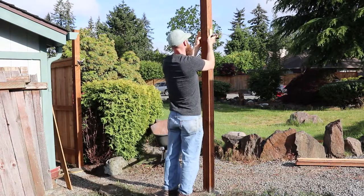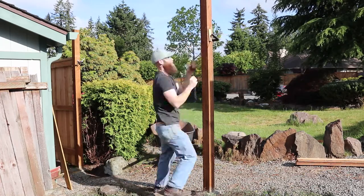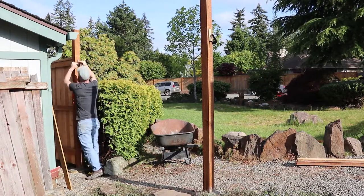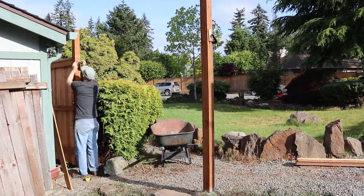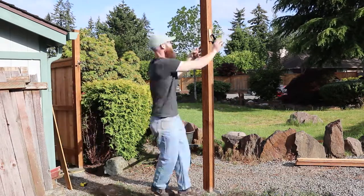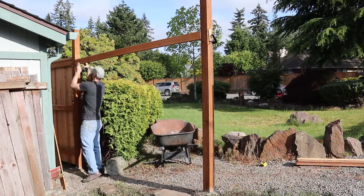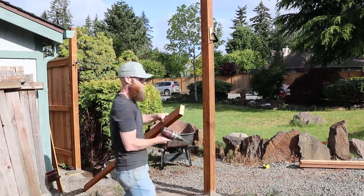You could use cedar rails, but they're a little bit more expensive. One thing that's nice about cedar is that it is naturally resistant to rotting and degrading over time, but it will fade if you don't treat it. Since you're paying a good amount for that wood, you're probably going to want to treat it and keep it looking nice. Toenailing your rails to your posts is a better and cheaper way than using brackets.